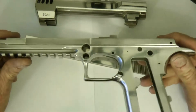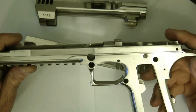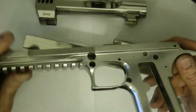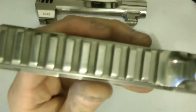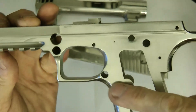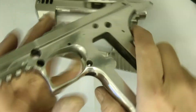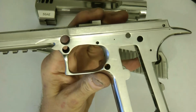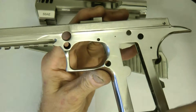What I did today is I went ahead and put it on a buffing wheel and polished it with mag wheel polish. Now you can see how it's turning out — there are some lines in here. What you want to do, as I've found out when polishing this, is if the lines are running this way, you want to buff this way. The lines buff out because you can buff them out.